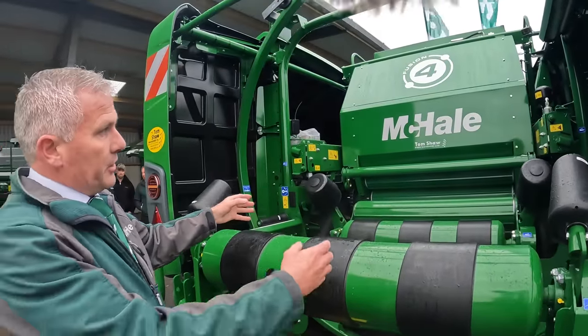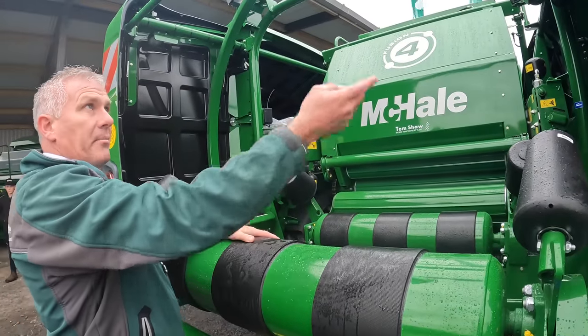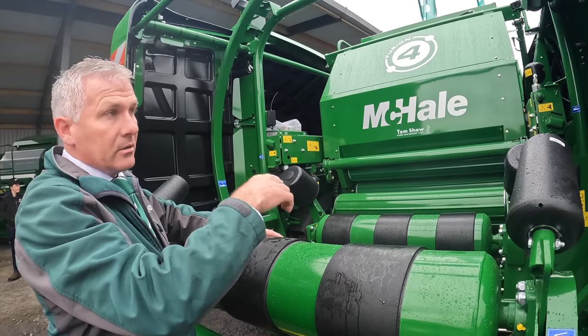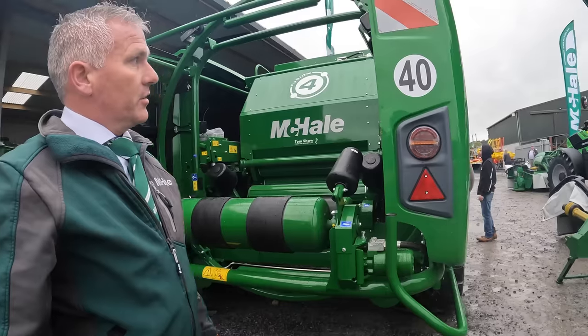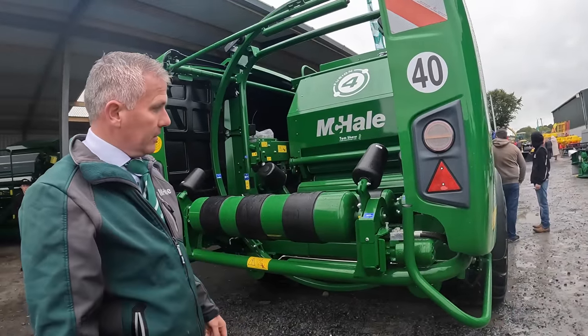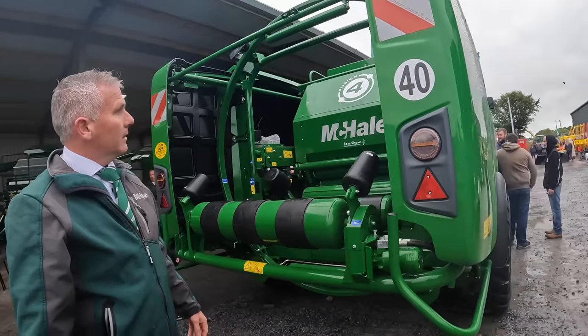So once the bale ejects from the chamber, hits the wrapping rollers, your wrapping ring starts up straight away, and it is actually spinning faster then as well. So you're not waiting for the door to close down to set up your wrapping. You're wrapping quicker. As more and more guys are on the 20 foot and 30 foot rows of grass, the wrapping ring is spinning faster. Yeah, so you're not waiting for the bale to be wrapped. Exactly, have it cleared quicker.